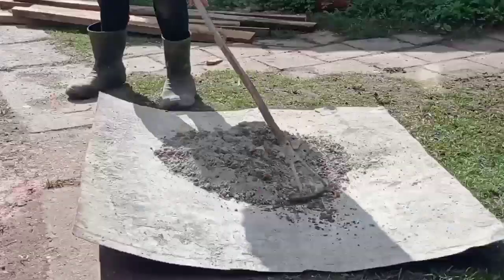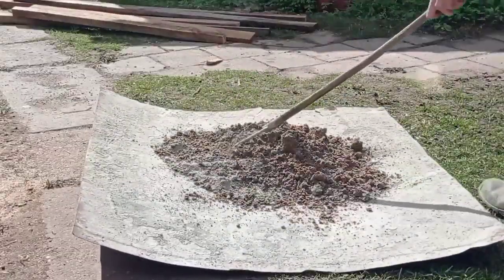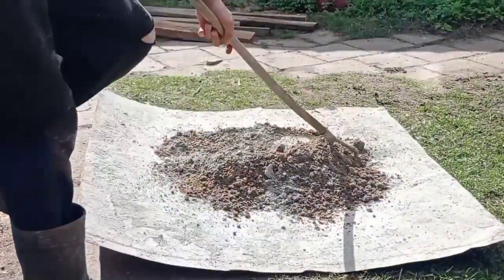After that it was easy peasy — just layering the bricks on top of each other. For the concrete mixing I also used my little hoe. Get yourself a little hoe and thank me later. It's going to be so useful for mixing concrete — a shovel doesn't even do as great a job, because you can just rake the concrete towards you, go around, and rake it back. Get yourself a little hoe, you won't forget it.